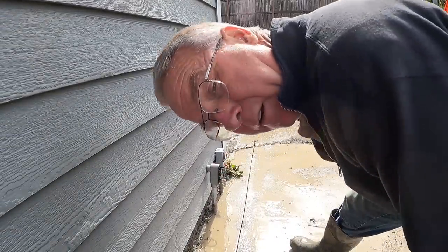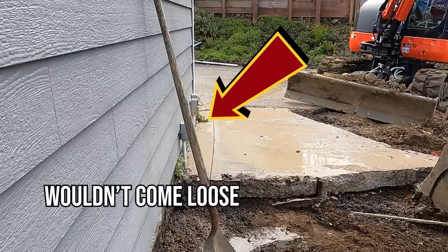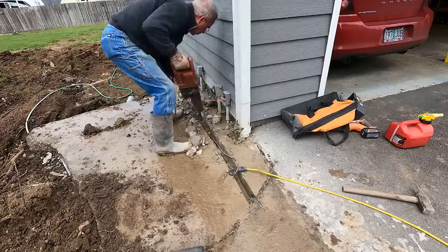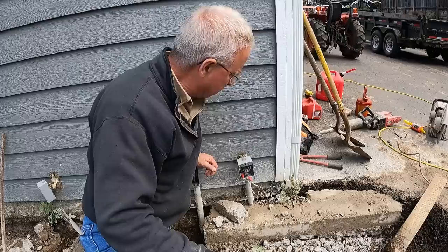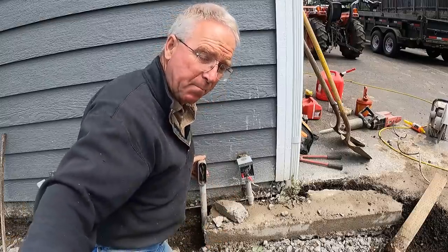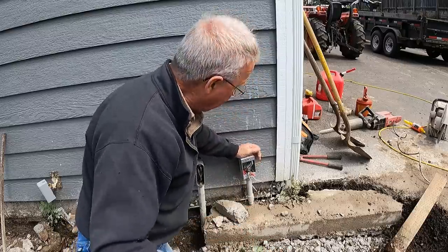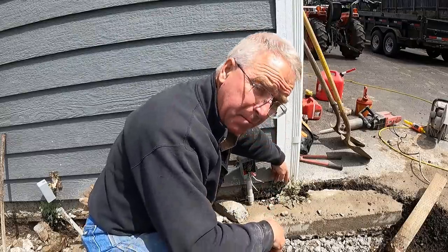I can't seem to make it come back. I'm going to uncover some of the dirt back here and see if that will come back a little. Then I'm just going to tug on this and see if that little strip will remain. If it does, I'll put a couple more cross cuts and probably just use a sledgehammer to break it away from this one and from the downspout over there on the end that I would really rather not have to repair. The LB has a low voltage feed for the sprinkler boxes in the backyard - that's intact, we didn't break that off. This other line can be broken off because it's going to be rerouted. We didn't hurt the gutter or the inlet into the drain for the gutter system.